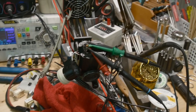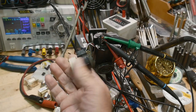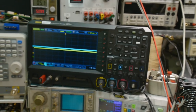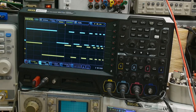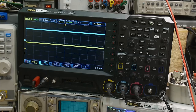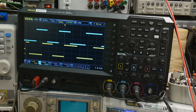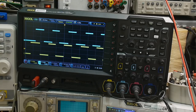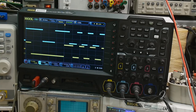I have one hooked up here — it's hard to see on camera because everything's a funny color, but this is the rotary encoder with a wheel on it and I can rotate it. We can look at the quadrature count on an oscilloscope. If I turn it one direction, that's the quadrature. If I turn it fast or slow — going in this direction, concentrate on that rising edge. I have a rising yellow edge and the blue is in the high state when turning clockwise. When I turn it counterclockwise, the blue is in the low state. That tells you whether you're going forwards or backwards, and you can get the quadrature count and speed from that.